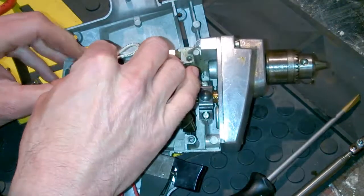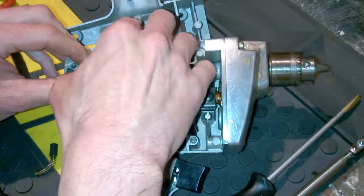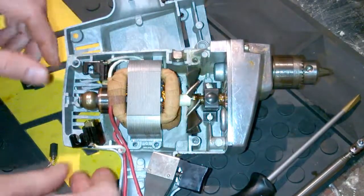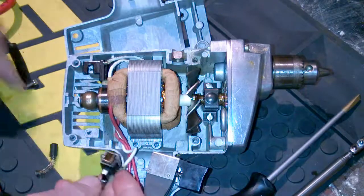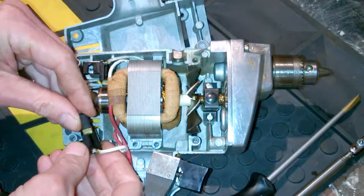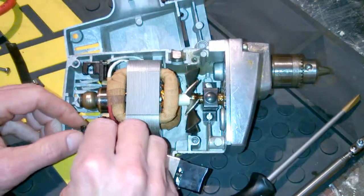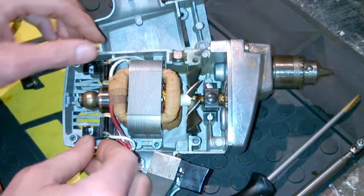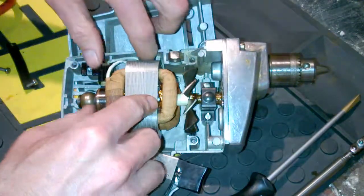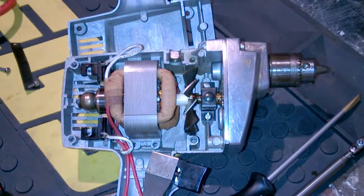Now there's a screw on the left-hand side I've got to put in. I've got to route the wiring. That's what I'm doing right there. Again, sorry about the knuckle vision here. There we go. So we got that in there, so we'll get a screw in. Oh, but first off, we'll do the bottom one. So you see the spring on the brush there? We'll get that in, like a jack-in-the-box popping out. Put that in. Notice it's brushing against the rotor there, so that's fine. We've got the white wire connected on the bottom, so that should be good. Just checking that everything's wired up, the wiring is routed in the slots properly.